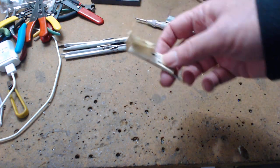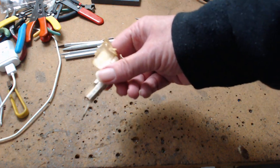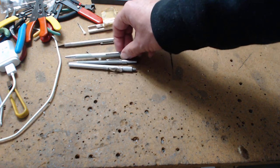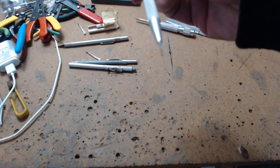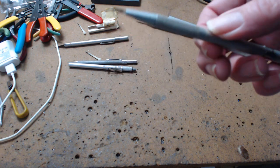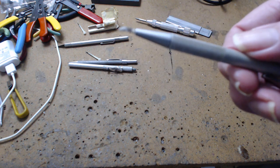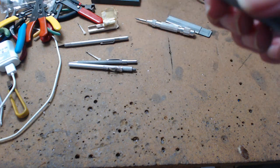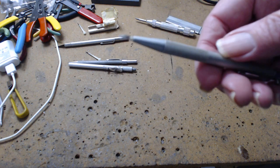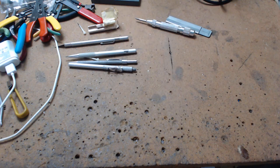But here's the box that those blades come in. And I have it taped. I had it taped, look at the tape, over the years it dried out. But this is the go-to X-Acto knife when you want to cut traces. You can cut really tiny traces. And the reason you cut the trace is you want to isolate the short, or you're doing a modification. Where I worked, you had a lot of boards that could be plugged in backwards, and they'd blow almost every IC out on the board. And you really had to cut traces. It was an everyday thing. It wasn't once in a while.